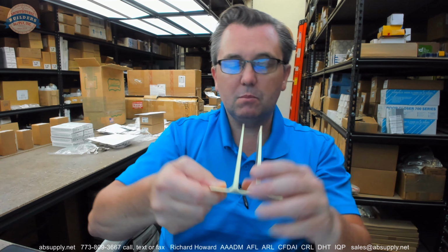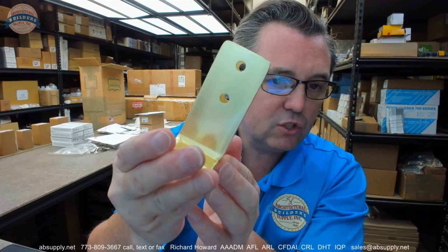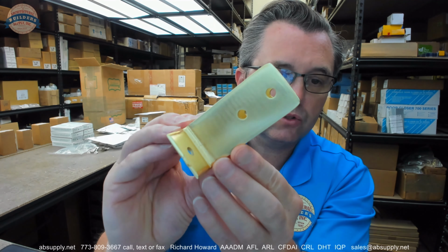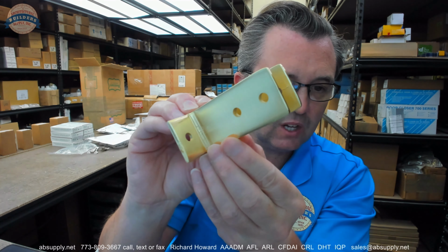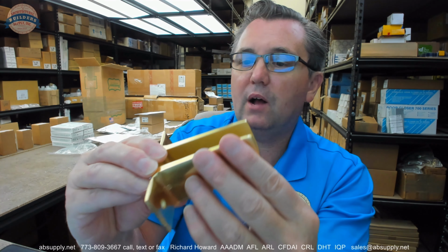606 means three things. It means it's made of solid brass. It means that it is in a satin brass type finish. And the third, it means that it has a lacquer covering it. So there's a lacquer coating over it. We can see a small amount of evidence of the lacquer here, a little bit of overspray on the product.